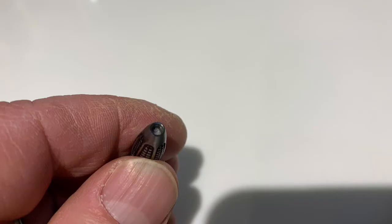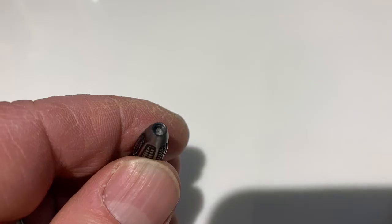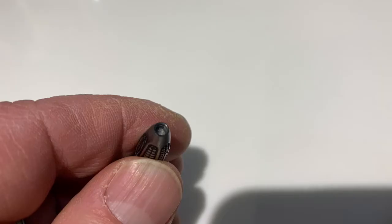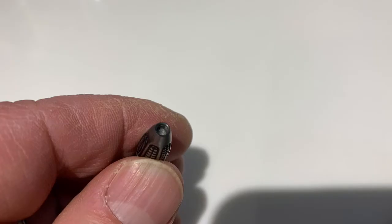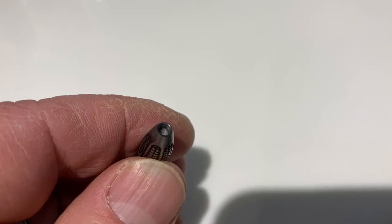The reason I'm doing this is because the tip sheared off flush. If it had broken beyond the end of the barrel there'd be something to grab — it's a pressure fit and could be pulled out. A machinist could bore it out but risks ruining the hole, making it too big for the new tip. Alum really is the safest last resort here.